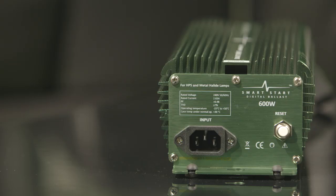With magnetic ballasts, they create a spike in electricity when you first turn them on — have new digital ballasts overcome that? Yes, that's correct. When you first flip the switch with a magnetic, you're delivering around a six-amp spike. The new digital ballasts have soft start technology built in, so you switch the power on, and the current is delivered after three seconds, then every couple of seconds after that, up to three to five minutes when the lamp is burning at full brightness. This gives you less chance of damaging the lamp or the unit itself.